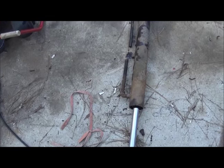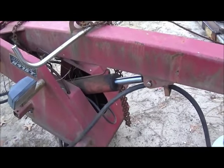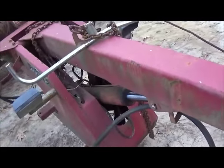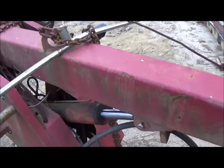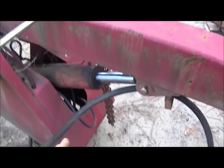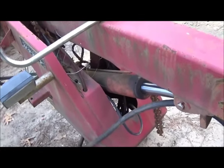One more decision I made: I don't think we're going to run two cylinders on this. Normally I always run two cylinders when I build them because of side-pulling off the boom when your cable runs out at an angle. But this unit, we're not going to have that problem because we'll be able to swing the boom in line with what we're pulling. So I'm going to go back on what I said and put a single cylinder — not this one, but a longer one that I've already located. We're going to put a single cylinder from the bottom all the way up to somewhere in here. No side-pulling, so we should be fine.